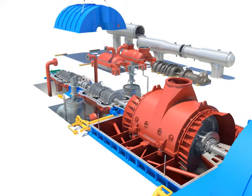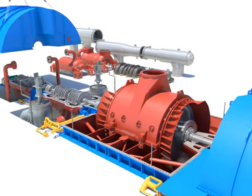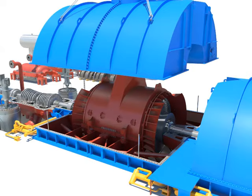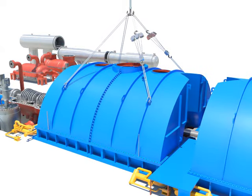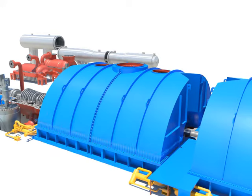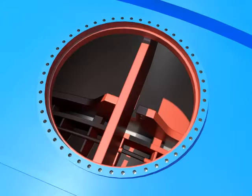Install the LPA hood, whose level has been adjusted, after moving it to the installation location, and be careful of the vertical flanges space of the gland packing casing. Tighten the LPA casing bolts. Assemble the rupture disc after assembling the keys.